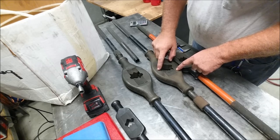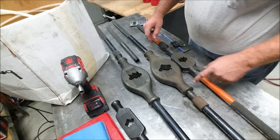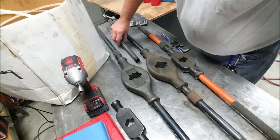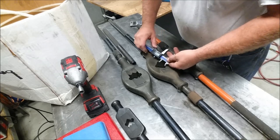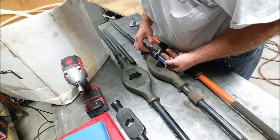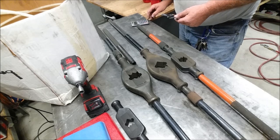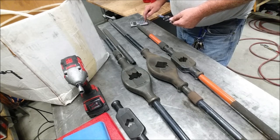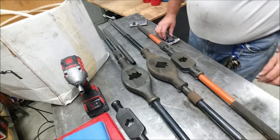Let's measure the two big ones. This is again a Greenfield GTD — Greenfield Tap and Die — number 22 tap wrenches. One of them has a bit longer handle than the other, but I have one spare handle. I grabbed all the tap handles he had. These guys are going to measure 2.327 across the diagonal. 2.327 divided by 1.414 equals 1.645 across the flats.